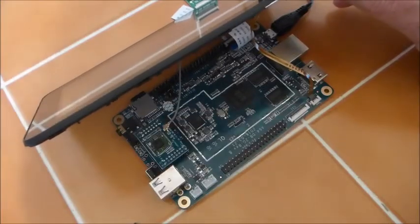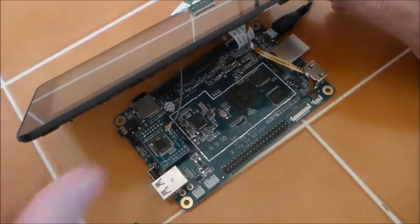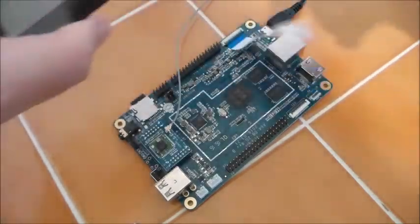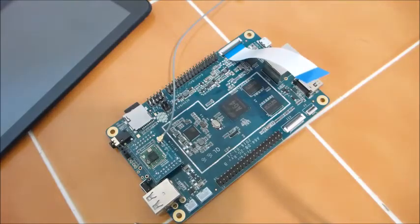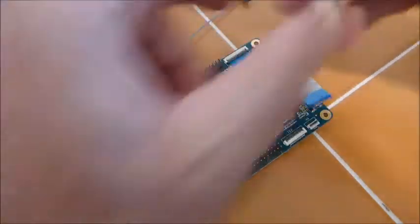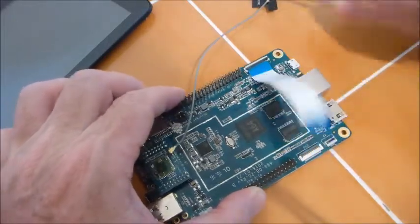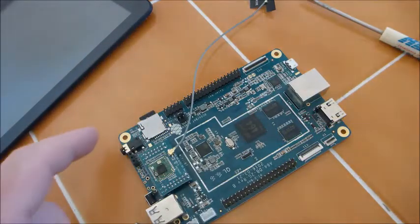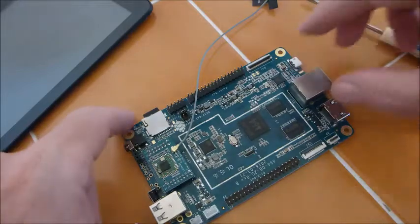It's right down there — let's see if I can get this open. Okay, that takes the monitor off. Obviously I should have pulled the power cord first. So that's out. Now it looks like I will not be using this very short ribbon cable, so I can take that the rest of the way off. This over here is the Wi-Fi and that, as I've said before, just pops straight down.